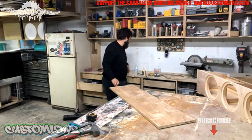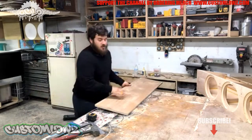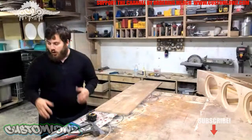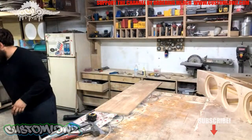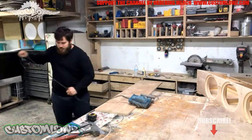All right, so we got all those marked out. I'm going to cut out one and then get a piece of scrap wood, stack it on top, kind of create myself a template to do the next two, just so I know they're all as even as they can be. So I'm going to pull out the jigsaw. We're going to cut one out.